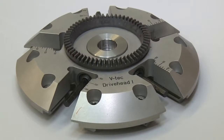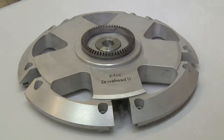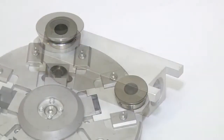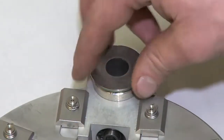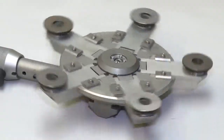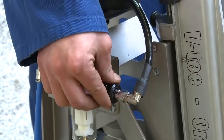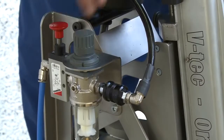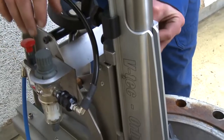The Orbit 24 is standard equipped with two gear operated drive heads and three sets of diametrically adjustable arms, covering all diameters within its working range. The advantages of the unique orbital gear driven grinding and lapping technology are: it produces the perfectly flat crosshatch machining pattern, and the five grinding discs rotate at exactly the same speed across the complete sealing face. As the grinding discs are mechanically driven, the material removal rate is much higher than conventional friction driven grinders.